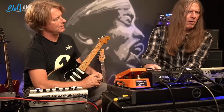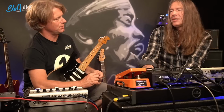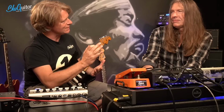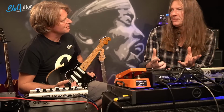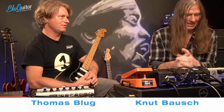But the overall latency from this device is about 1.5 milliseconds. Yeah, it's pretty fast. But the wireless can go up to 3, 4. Yeah. And then it sums up, and then there is a critical point. Anything higher than 5 makes me feel scared. That's me. Then you have digital consoles. It converts the input audio, and the output is also converted and goes back to the monitor or in-ear. So that adds up too. And this is getting very, very critical. Yeah, I agree.